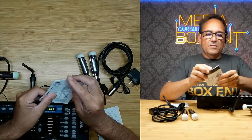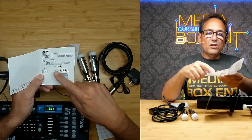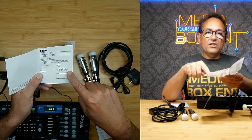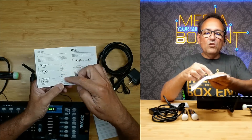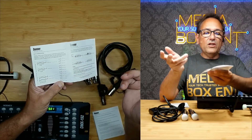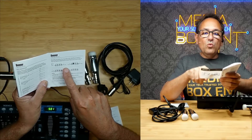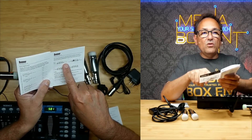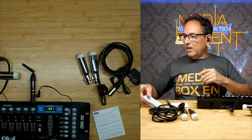The instructions are pretty clear — they show you different ideas on how to control the lights. So you have one transmitter and you can use multiple receivers to control different lights. You can also use a DMX optical splitter, or you can create different groups. There's an option that allows you to connect two channels so you can group them for multi-channel control. You can also put another transmitter with another group to talk to a completely separate set of lights. There are a lot of combinations.